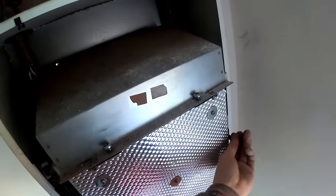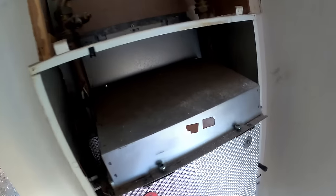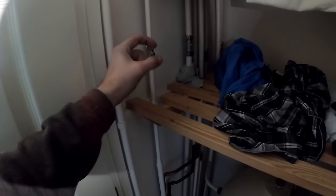I'll get the cold feed off. You can drain the heat exchanger from there and probably pop a hose straight in. Get the flue disconnected — this boiler looks like it lifts up and then out. This is the airing cupboard. Somebody's put a service valve on the heating cold feed; we're probably going to change that for a lever. For the time being I'll just switch that off. It's only a small bore, comes down into an air set — that's our vent, that's our flow from the boiler.